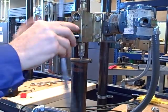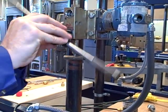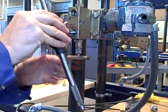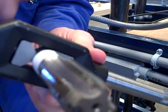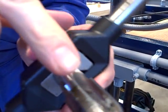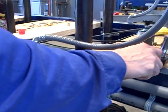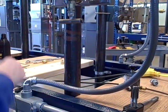At this point we can take a pipe fitting, thread it in there, and see how it fits. I also want to show you the chips that we cleaned out — that's the metal we cut, so we actually did remove some material by threading in there. I can just tell by looking at it, it looks a whole lot cleaner than it did before.